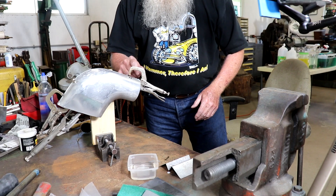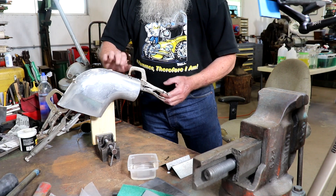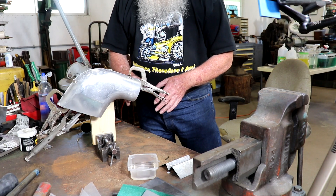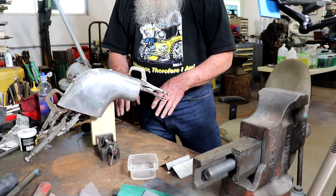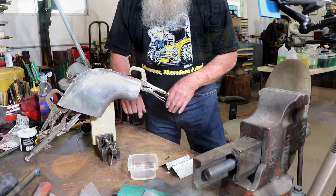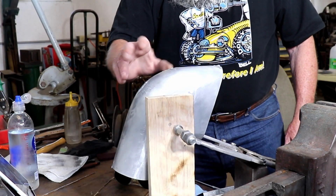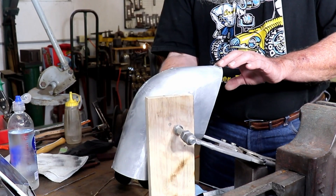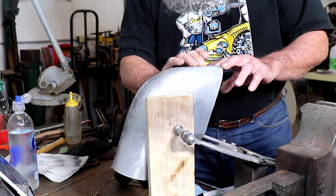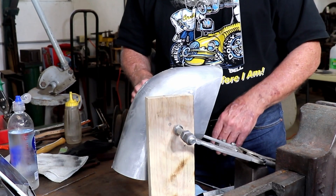There's about a half-inch tack right there. I can turn this over and start tacking the bottom side and flushing up. Almost all of this is good as it is, but it'll take some just light tuning to bring it in to where it's got to be so the finish is perfect. Now that I've got a few tacks in different places — both on the back side and on the inside — after I tacked those up I got all of the seams just nice and flush. With that, let's get to welding.